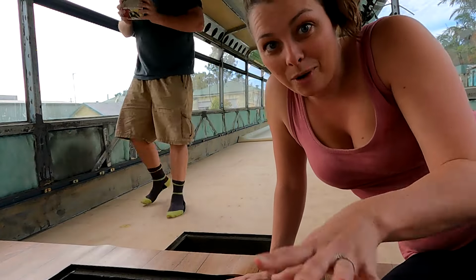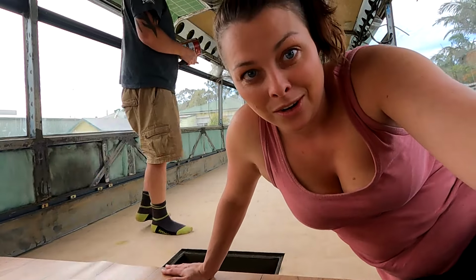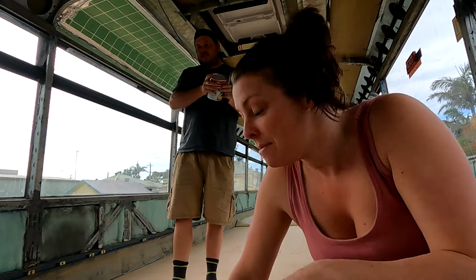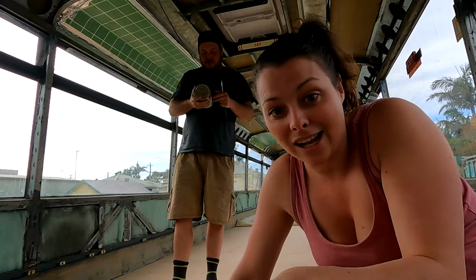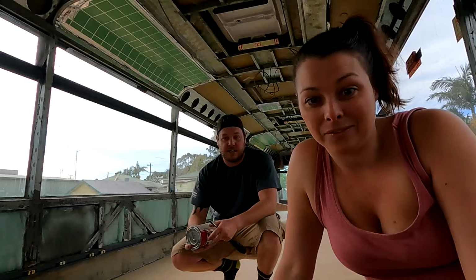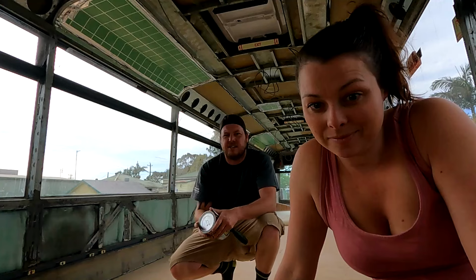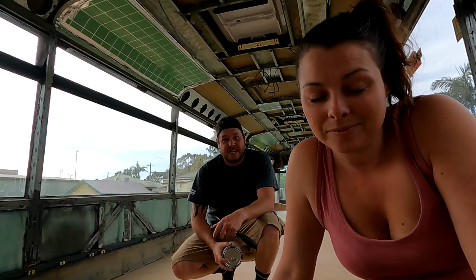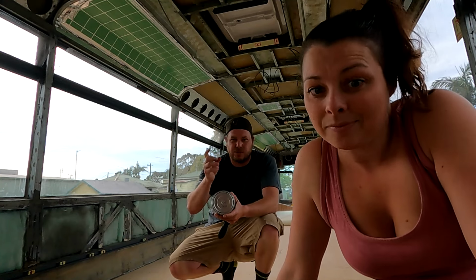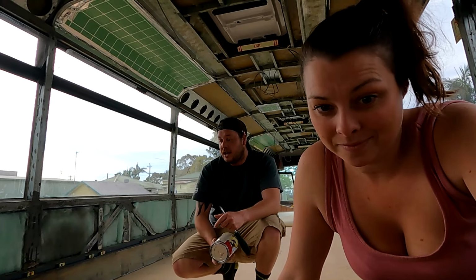We just had to do a quick practice run to see if we're going to be able to walk the vinyl out. It says that the glue actually needs to set before we lay it out, so we've kind of got one shot. The adhesive actually has to go off first. When it goes off, you'll find it's just sticky, it's not sticking to your finger anymore. And at that stage, you'll see it start to change color. It'll go transparent, same as the adhesive glues for roof linings. This is going to do exactly the same thing.